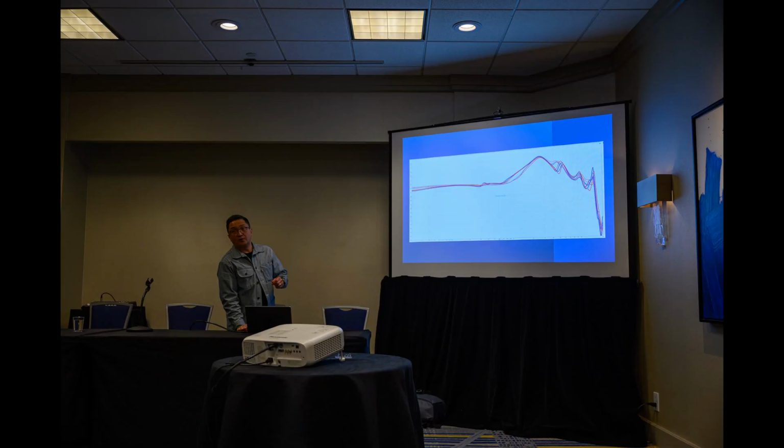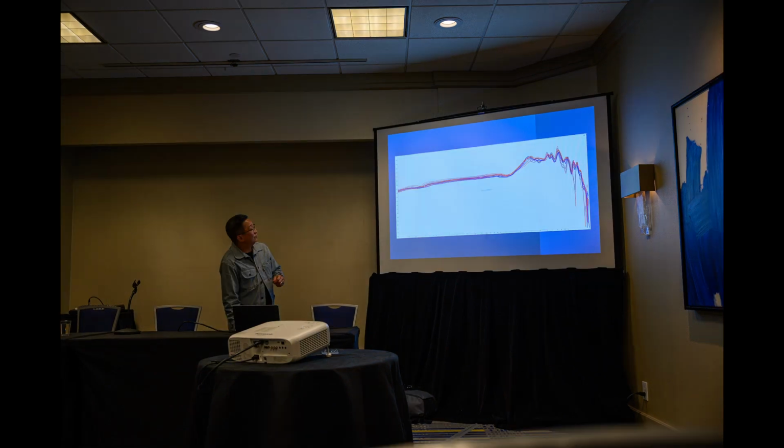Let's go to presenter mode. That is an Etymotic ER4XR, I believe. I think that's an XR, yeah. That is 4.4 and dotted line, 4.3. 5128 is a solid. That is an HD800S, 4.4. This is unnormalized, and I use 80 dB white noise to set level. Solid line is, here, let's just do the average. There's the average of the 5128 in the dark versus the individual seatings of 4.4 on the dotted line. I think that's all I brought.